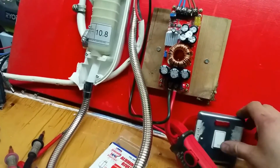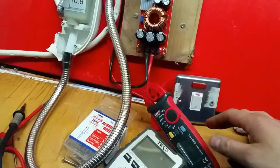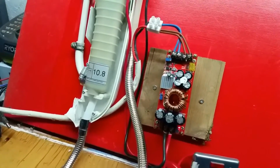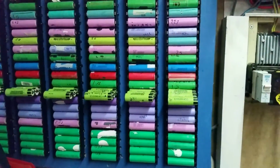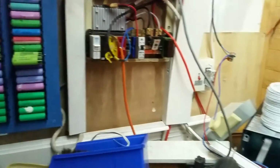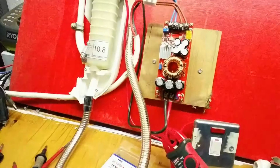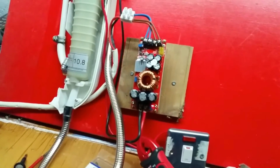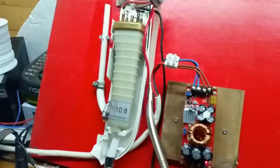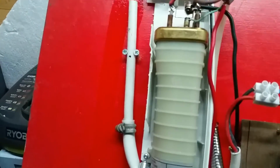I really want to be a sport, but I can't find my IR sensor. If I'm pulling 30 amp at 24 volts, then I'm putting a lot of strain on the cells that were over there. And I think what I want to do before I test at a higher voltage with more amps is actually double up some of my cells so there's less sag. I am noticing there's some sag on pack 8. There's nothing I can do about that. But the inverter's kicking out because it doesn't like the low voltage. But this thing is boiling. Here we go. Getting puffs of steam coming out there.